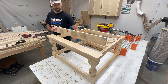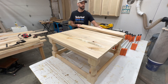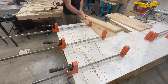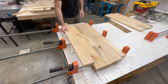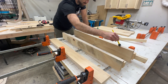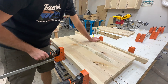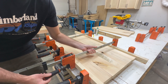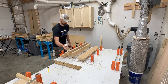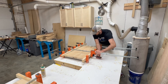The width of the individual tabletop pieces doesn't necessarily matter — in fact, all my pieces were completely random widths and nothing matched up, and I thought this made it look even better. What is important is the length of each piece, being that each piece is as long as the total width of all the pieces put together. On this table the total width and length of the tabletop was 36 and a half inches, meaning all these pieces are slightly longer than that — we'll flush cut them after the glue up, but the cumulative width also needs to be 36 and a half inches.